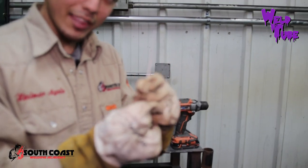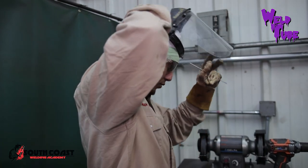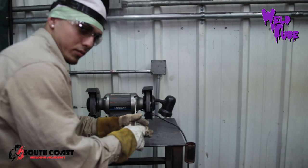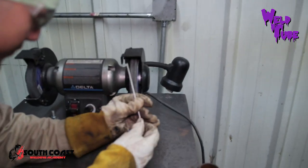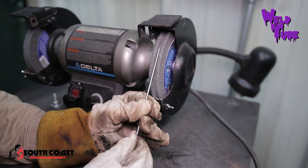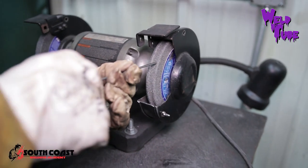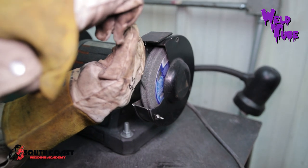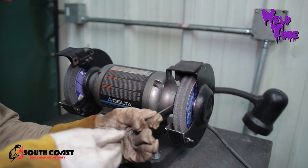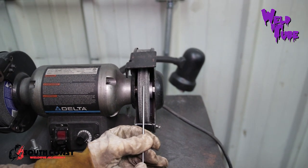The first way I'm going to show you is with your hands. This is the proper way, so let me put my headgear on — face shield. What I'm going to do when I turn on the tungsten grinder is just turn my tungsten little by little in circles. Do not sharpen it straight on because it will break and kick at you. Don't sharpen it like that — some people do, but it's no good. As long as you have a little bit of angle on your tungsten, it should grind fine.